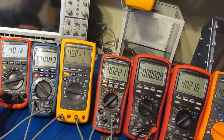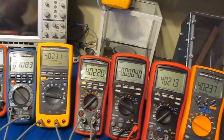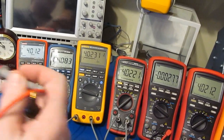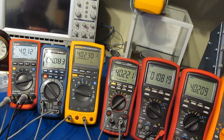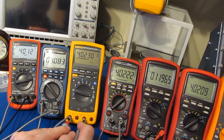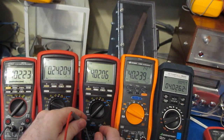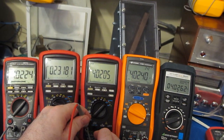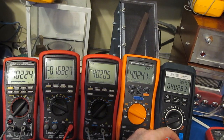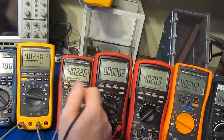Now re-strapped to the high-current jacks at about 4 amps: the modified UT61E reads about 108 millivolts, the SEM about 173, the Fluke 187 about 120, the BM789 about 94, the BM869S about 230, the Keysight about 133, and the Gossen Ultra about 167 millivolts. So for the higher current ranges, the BM789 has the lowest burden voltage.